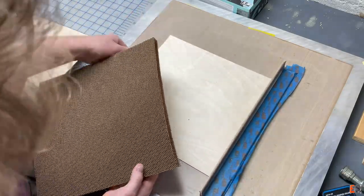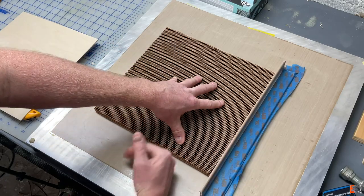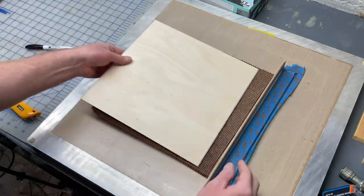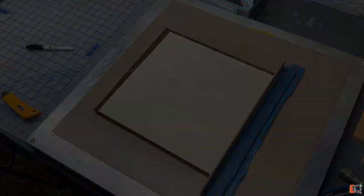This is 15mm Nomex Kevlar-like honeycomb paper that's glued together to make a honeycomb core. It's available and usually used for pretty high-end, high-performance things, but you can buy it surplus, usually for pretty reasonable. And it's very lightweight, very stiff, and pretty impressive stuff.